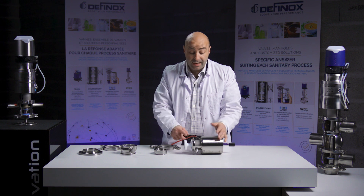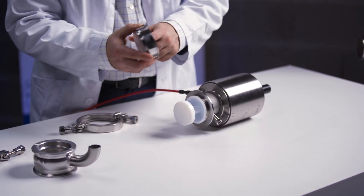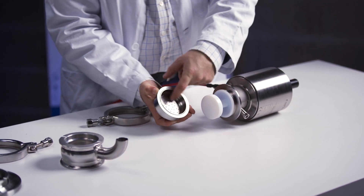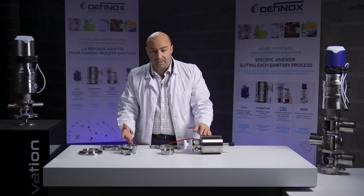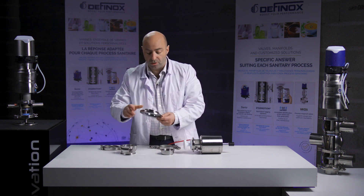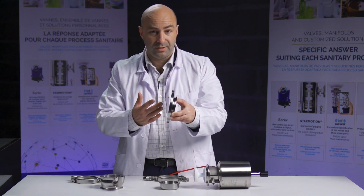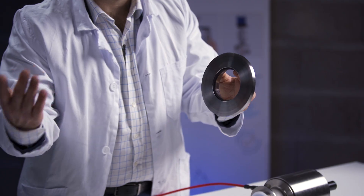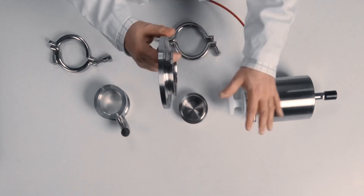This plug is made of PFA. It's quite interesting because we do not have any additional gasket to ensure the sealing between the spraying plate and the plug. We have a small bump, and this bump contacts a flat surface inside the spraying plate to ensure a perfect sealing system. This valve doesn't have many gaskets inside — one gasket in the body and one gasket in the flange welded into the tank. We also save on the number of seals because this valve doesn't require tilting, so there is no protrusion into the tank volume and no need for extra gaskets to ensure the sealing between the body and the flange.